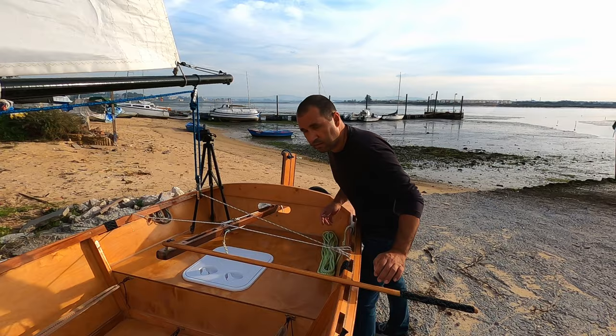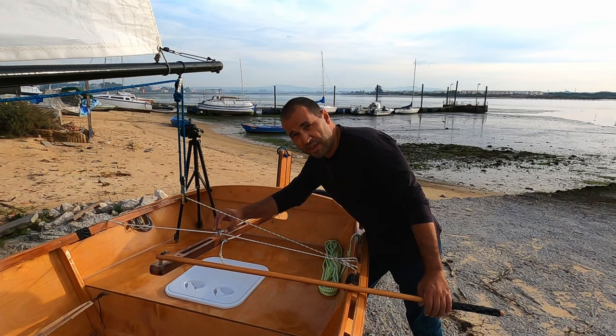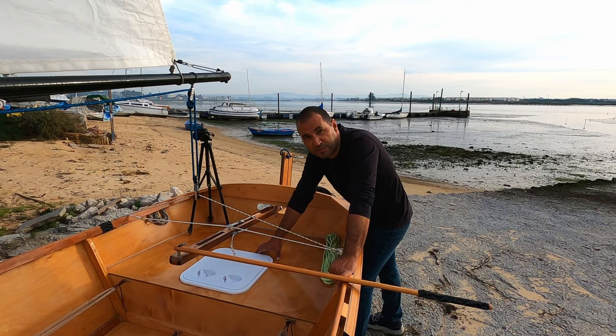It's still possible to use the rudder if you have to, but from this end it's very, very hard to move the rudder — which is what you want. While here at the tiller it's much easier. This is the reason why I put the system here and not back by the rudder, because I have much bigger leverage in relation to the fulcrum and the rudder.